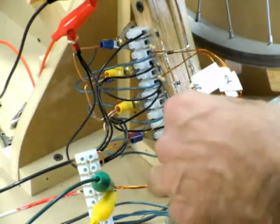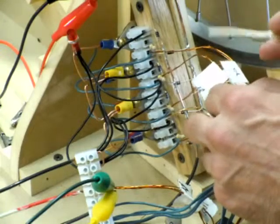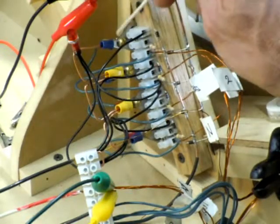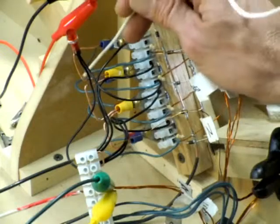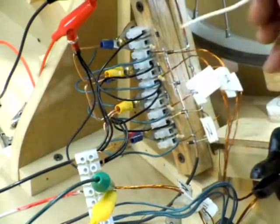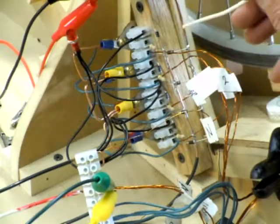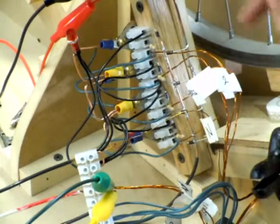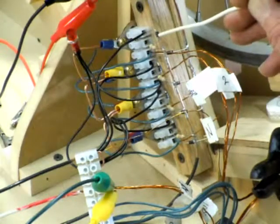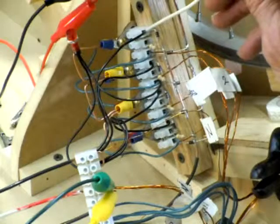From the end of the coil winding, I paired up the two wires and connected them right to the collector, which is this green wire here attached to this. Off the collector comes here — two of those — and then we've got our 4007 diode which connects to this bus here. Then we've got our 4001 diode right here, which is going from the emitter to the base.